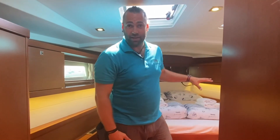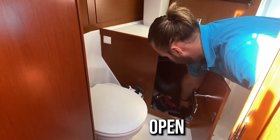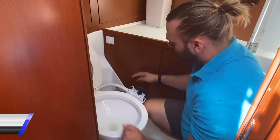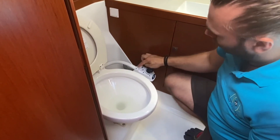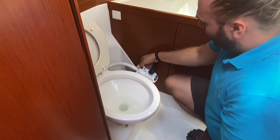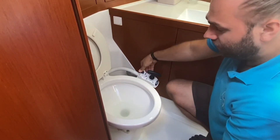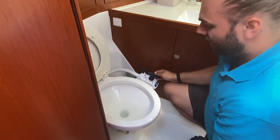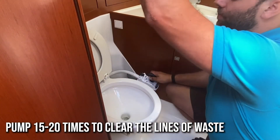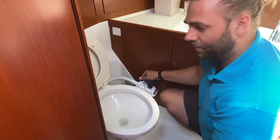The second bathroom on board Nelly is in the owner's cabin in the bow. The valve for the black water tank is inside the cupboard — in line means open, across the line means closed. To operate the manual pump toilet, you have two positions on the control. When pushed over to the right, it takes water out of the bowl and into the black tank. When pushed over to the left, it pumps water in and takes water out. When coming to the toilet, pump a little bit through the system first. Once you have been, flick over to the right to remove the waste, then move the switch to the left and pump 15 to 20 times to get the waste all the way through the pipes and down into the black tank. Remember to flick over to remove the water to pump out when you are sailing.